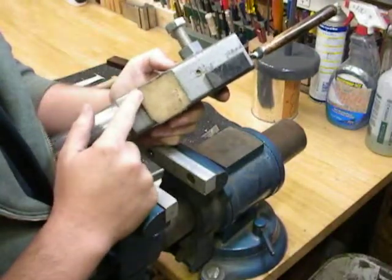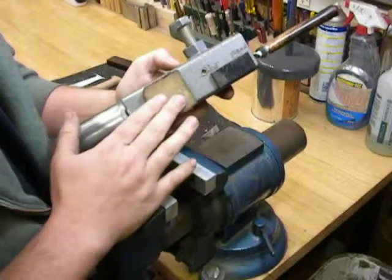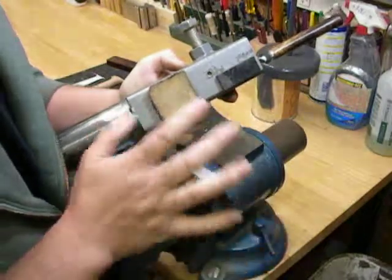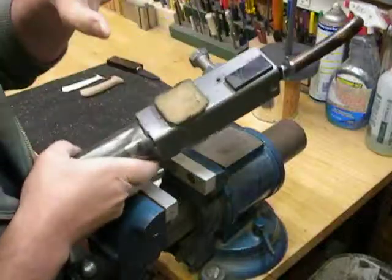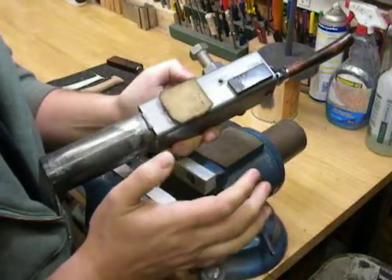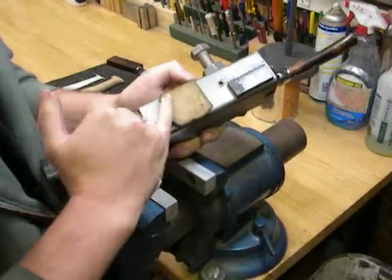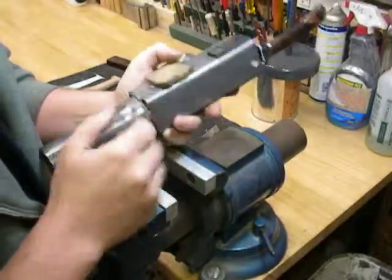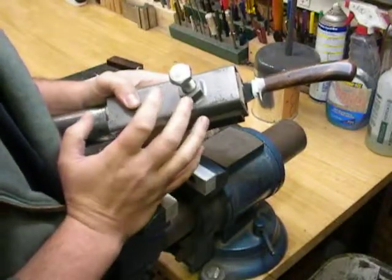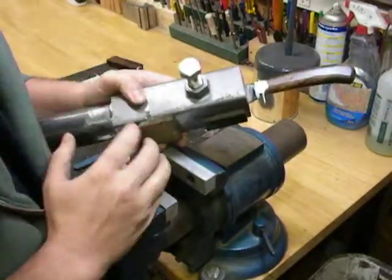And then the abrasive cleaner with the coarser sandpaper, like 120 to 320, you can actually get rid of some of the gunk in the paper with the abrasive cleaner. The finer grits, it's not worth wasting your time, in my opinion. But anyway, it looks weird, but that's why those are on there. It's very handy. I don't do a lot of shoe shining type sanding, but the very little bit that I do, you rub the emery cloth on there, it gets clogged up. You can run it against this and it cleans it out really easy. So that's why that's like that. Again, this is very simple, but it's a super functional tool, and I use this one or a couple different sizes of this on every knife that I make.